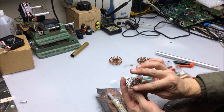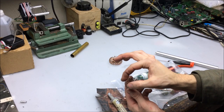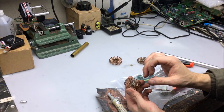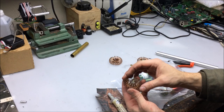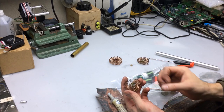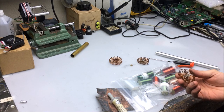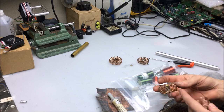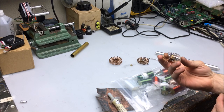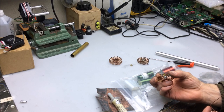In terms of whether this is better than a solid surface: at the extremely high frequencies, the electric field surrounding these wires expands both outwardly and axially in concentric circles. So you end up with an electric field at high frequencies that basically treats this object — even though it's made with wire — as a solid object, as if it were a completely smooth coated surface. The downside is that the capacitance drops because you don't exactly have the same surface area. You do have a correspondingly lower capacitance at lower frequencies. It really depends on the potential, but basically this object at a higher potential will act more like a solid object than a wound piece of wire, and at a lower potential it'll act more like a piece of wire.